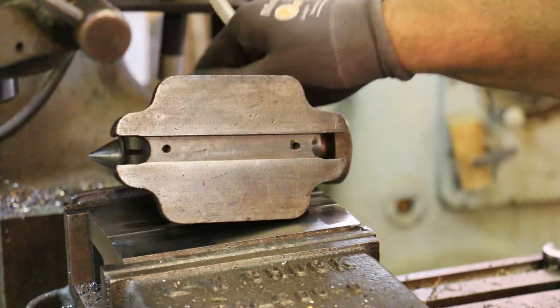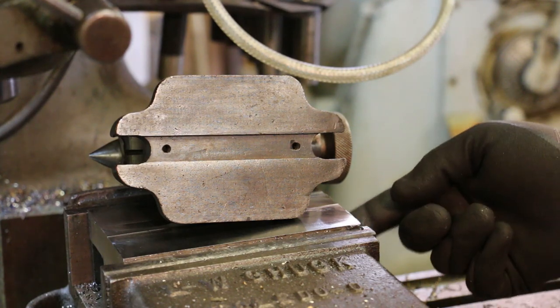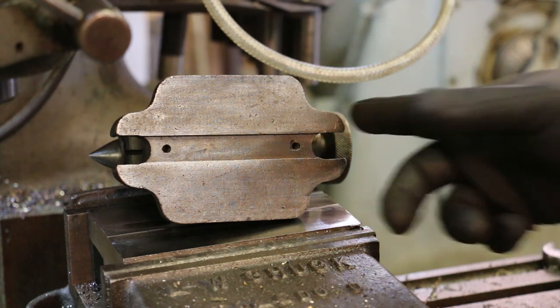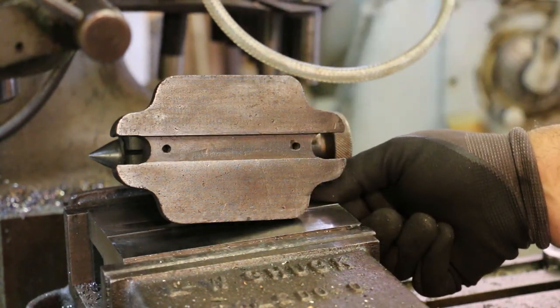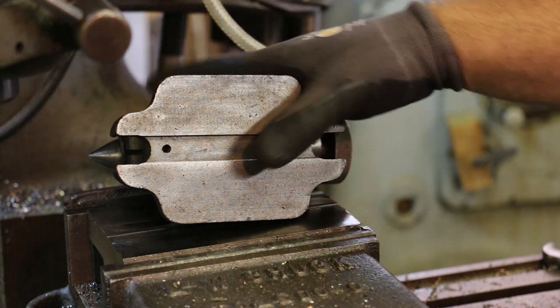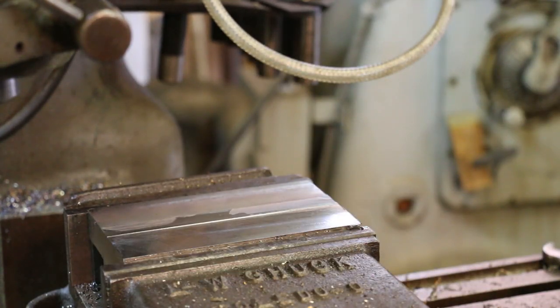So there are a couple of holes up in here. Probably what I'm gonna do is we're gonna go ahead and drill for those, countersink some socket cap screws in there, and we'll bolt this to that so this is snugged up on there good and tight. And that should keep it permanently attached and from moving around. But I really wish that I had a little more material on there and hadn't pulled my bozo card out when making this, so we'll make do.